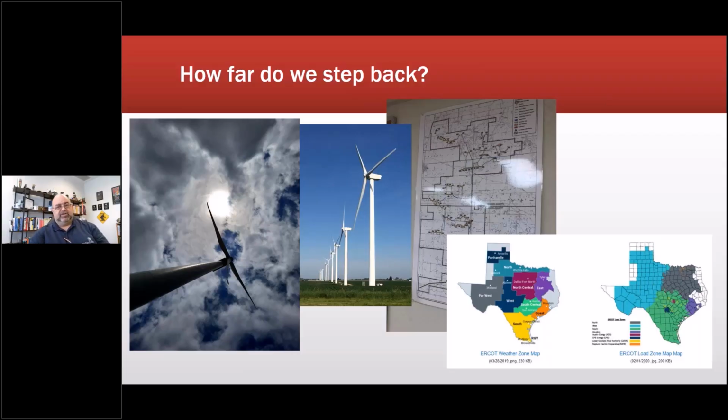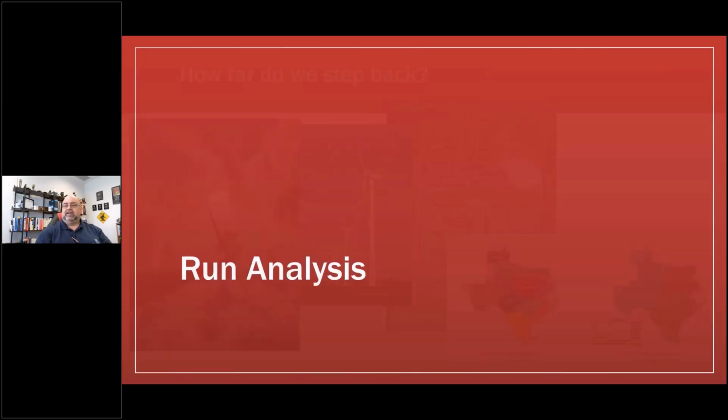We're hoping that there are different types of controls. These are old towers that use what's called grid following, meaning the output frequency and voltage depend on what's present on the line, so it kind of follows along. The new control type they're talking about, because a larger percentage of the energy produced in certain areas will come from these, and we don't have the large rotor inertia that you would in a larger generator, is what's called grid forming controls. I talk about them, but they haven't really been applied yet. We're trying to determine if those are going to cause more failures or if they're going to eliminate this particular failure defect.